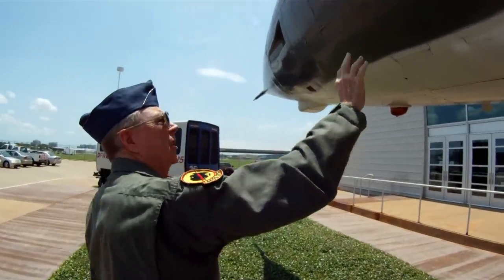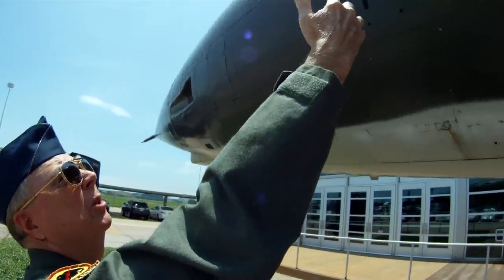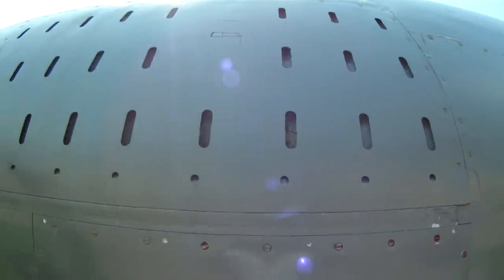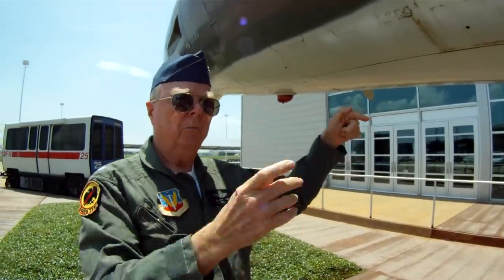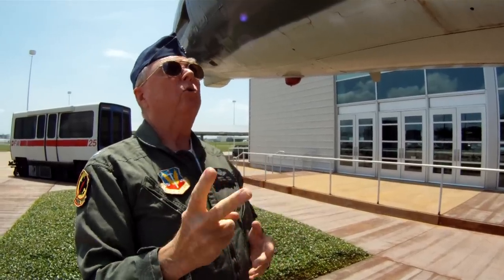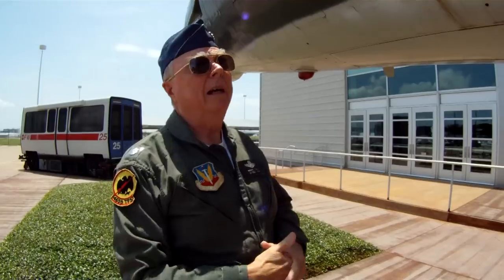Over here is a hydraulic gauge — you normally check that for the pre-charge. This is the gun bay, and normally this would be down. They cut these slots in here later on; the airplane was not like this originally. They had a couple of airplanes where, when you're firing the gun, the unburned gases would build up in here. There's a gun purge system that bleeds air from the engine to blow those away, but if that gun purge fails or the circuit breaker pops, they would build up, and on two airplanes it blew this door completely off. It didn't hurt the airplane — the guy flew back and landed.